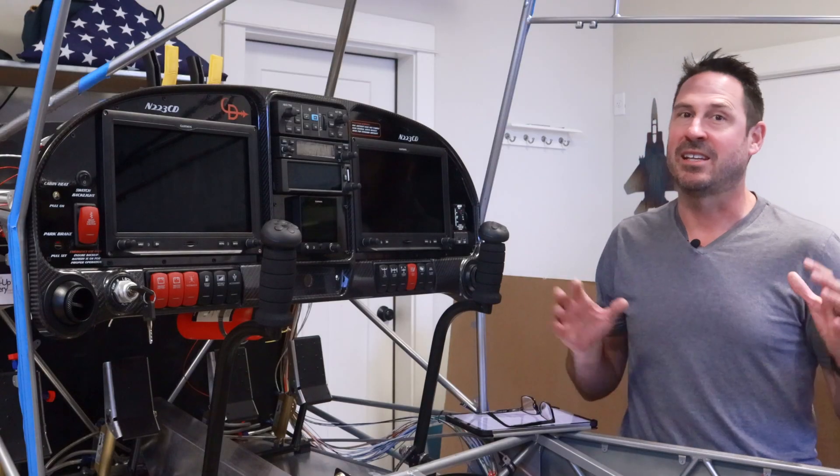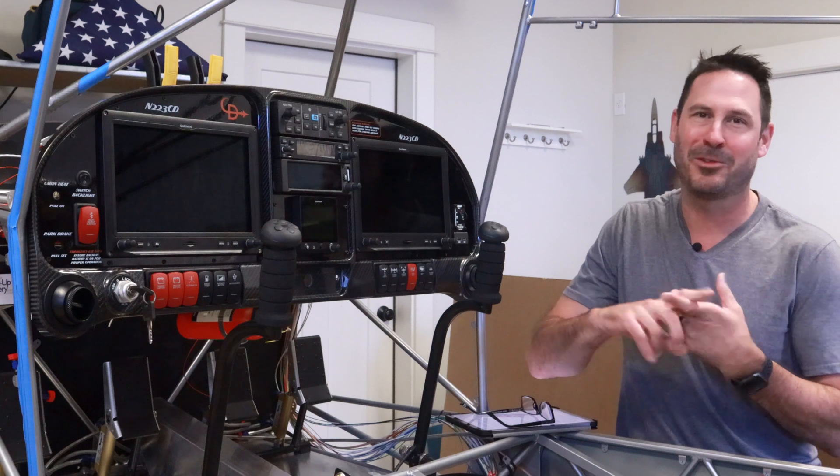Overall, this was a resounding success, and I do have a few people I'd like to thank. First off, Jess Veruta of NewView Technologies in Oshkosh — thank you for patiently teaching me the fundamentals of wiring this CAN bus-based system, and being my wise consultant along the way, and also my friend. Thanks to Chad at Vertical Power for validating my VPX support configuration plan. And finally, Bob with TCW for validating my very non-standard backup battery plan so that I can divert power from backup avionics to one of my electronic ignition systems with a single battery. In short, it involves strategically placed diodes to ensure current flows to where it needs to go in case of an engine-out emergency and doesn't backflow charge to the main battery.